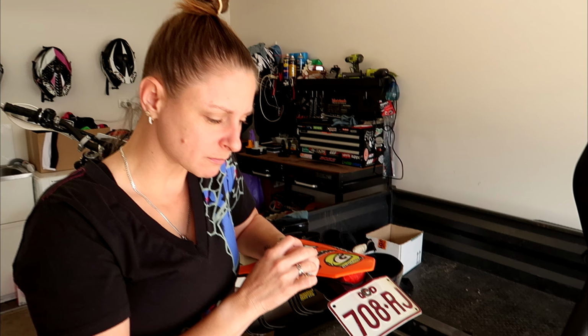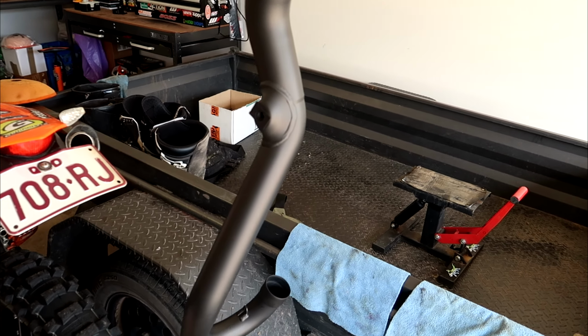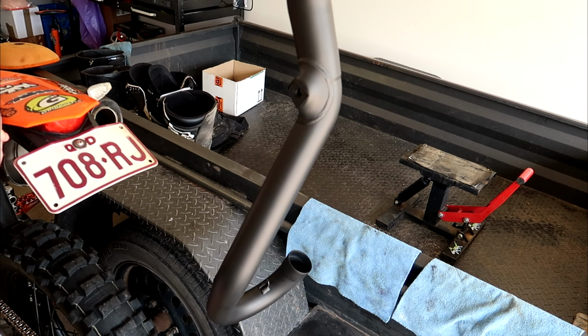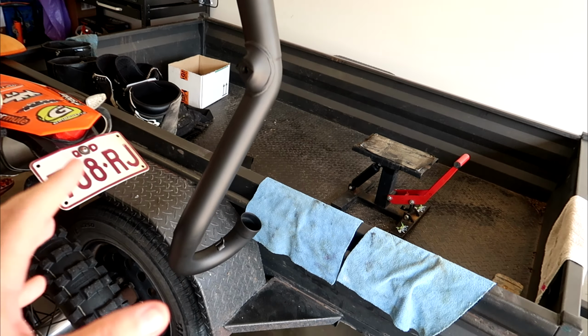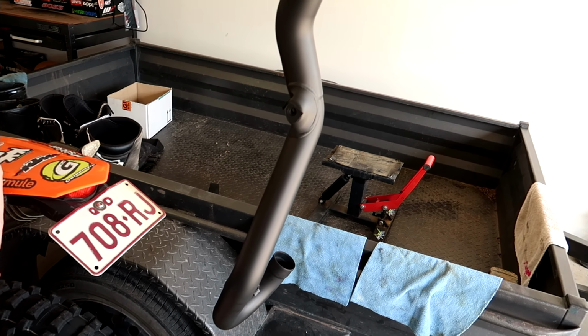It probably would with a bit of gumption, but even if you use gumption, you're going to wear it. It's going to wear into the paint. Anyway, it needs to be repainted fairly often or cleaned somehow. But the big thing is obviously with this ceramic heat paint, you have to cure it, and we don't have an oven big enough to fit that in. You're supposed to put it in at 200 degrees for...